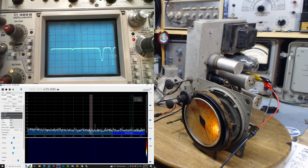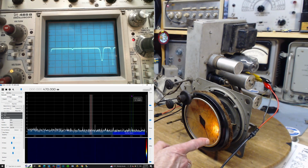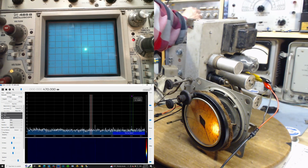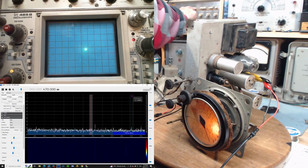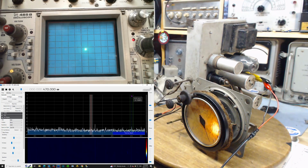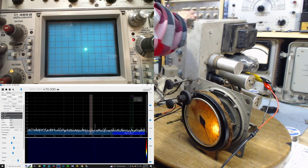See anything? So the radio's actually not tuning anything in because the sweep is falling short of where the radio is tuned. So I'm going to make the sweep go way up higher, way up through the broadcast band, 1600, starting at 540, starting just in the dial and going up past it. Let's sweep that and see what happens here.